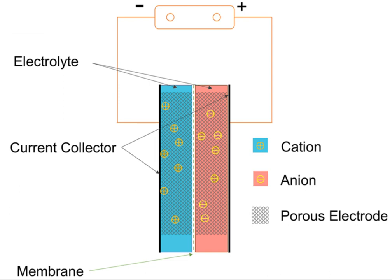Such a peak power current for power applications for supercapacitors of more than 1000 F can provide a maximum peak current of about 1000 A. Such high currents generate high thermal stress and high electromagnetic forces that can damage the electrode collector connection, requiring robust design and construction of the capacitors.